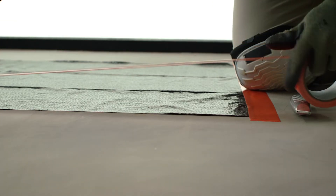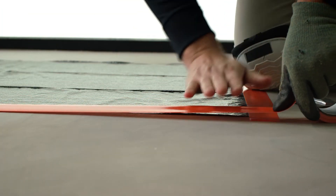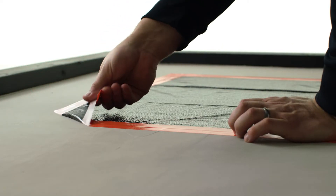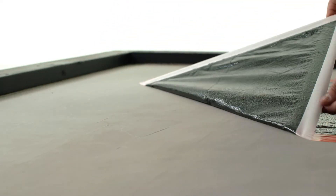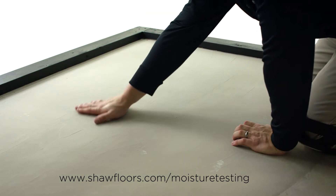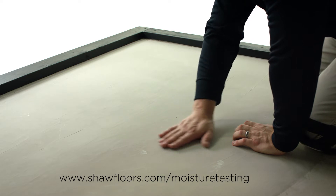Another important part of your prep work is moisture testing. Moisture under your floor can be its worst enemy. You can buy an expensive tool to test this, or you can easily test your concrete subfloor for moisture by taping a trash bag to the floor along all four sides, creating a seal. After 48 hours, you can check to see if any moisture was captured by the trash bag. If you do think moisture might be a problem, it will be necessary to use a more advanced test — follow the link below to learn more.